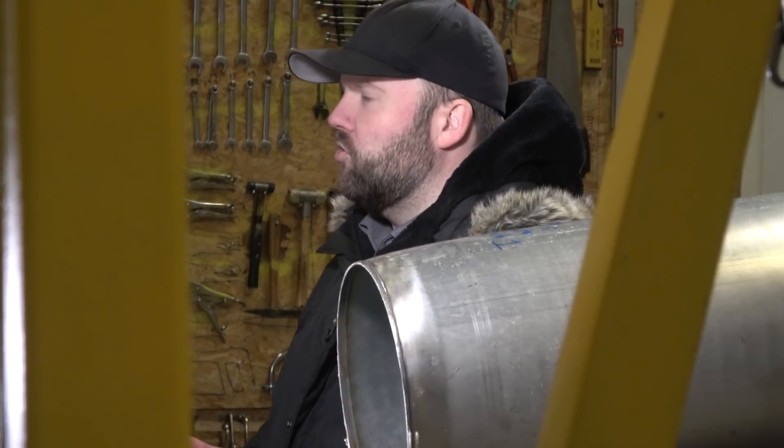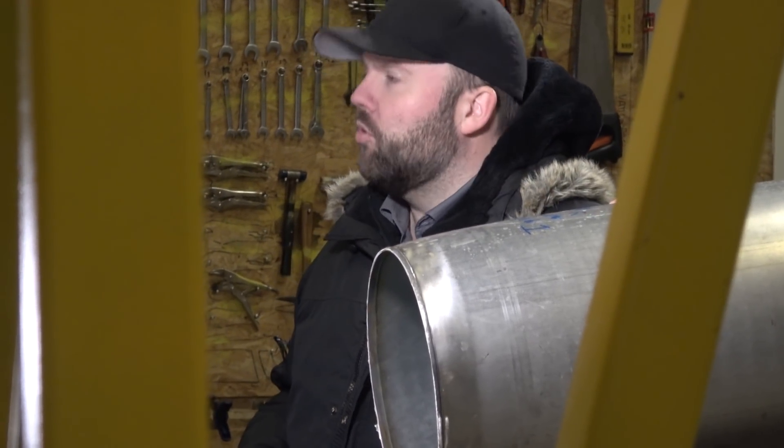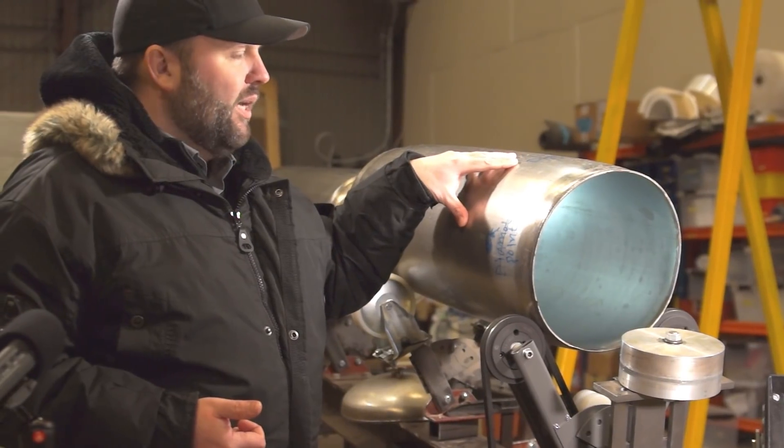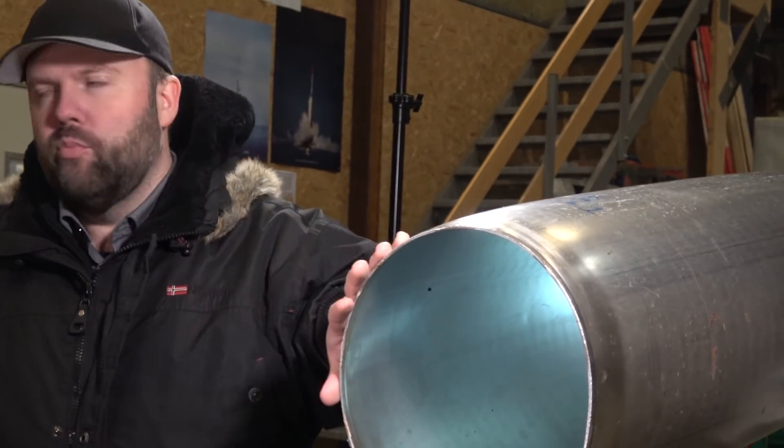That is what we've been doing so far, and just within the last couple of weeks we actually manufactured a couple of prototype tanks — really test tanks. The basic idea was: this is a two-millimeter stainless steel standard pipe. We welded on a couple of two-millimeter end bottoms, and then we simply started pressurizing them these last weekends, just to see when they would rupture and how they would rupture. For the two tanks initially produced, the goal was to perform a destructive test.